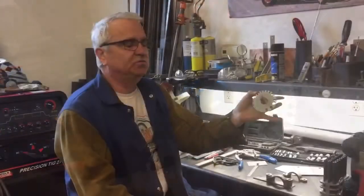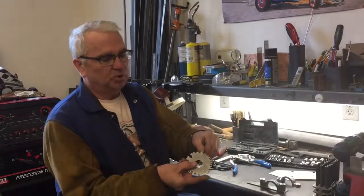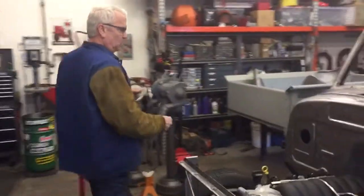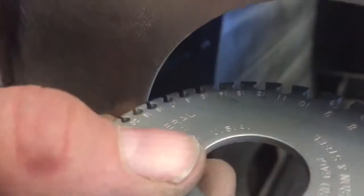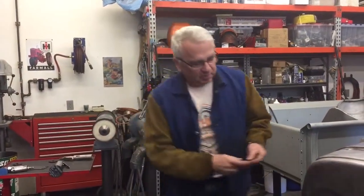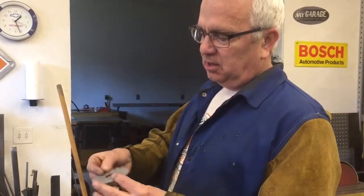This tool here — you've probably seen pictures of it and wondered what it was — it's a gauge for sheet metal and metal thickness. It lets you quickly take a piece of metal and find the thickness where it fits really nice. For example, 21 gauge. If I'm making a patch panel for my truck and I want to fill a hole, I take my gauge, do a little test fit, and — look at there — 18 gauge. Now I can go to the metal shop, get some 18 gauge steel, and know the thickness will match perfectly.